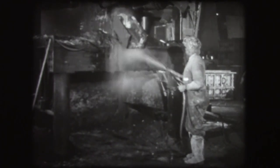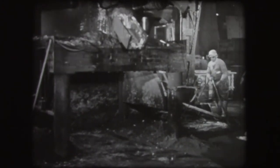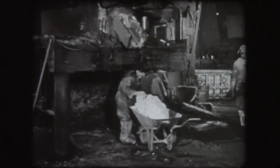Before applying the daubing mixture, wet the surfaces to be repaired. In this foundry, a hose is used. Frequently, a foundation coating of clay wash is applied instead of plain water. Daubing mixture is applied with bare hands, and for best results it is thrown in place. This helps to fill up all the holes and to secure firm contact between the daub and the solid lining. The aim in repairing the lining is to build up a surface which will be just as heat resistant as the original lining. Make the lining as smooth as possible so that slag will be less likely to adhere to it.